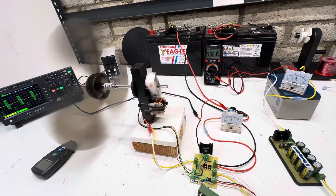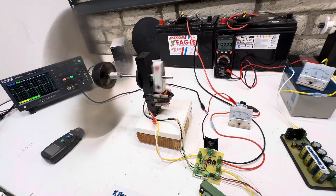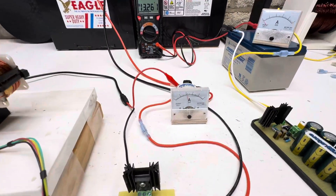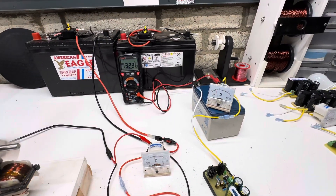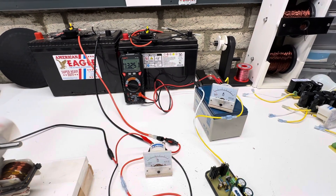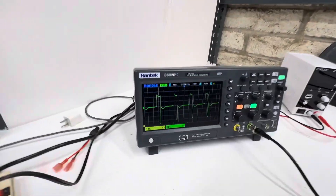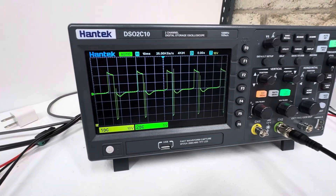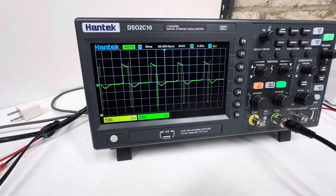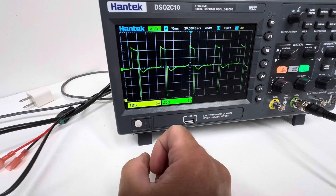Let's just bring this thing up to full power. We're doing just a hair over two amps. Here's our output pulsing once a second — three amps. Here's our full waveform. You can see the bottom going down with the cap dump as it's charging and discharging.